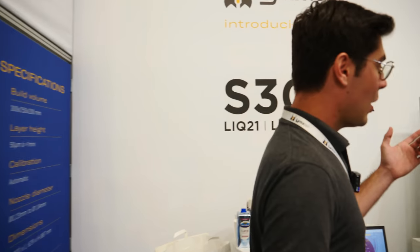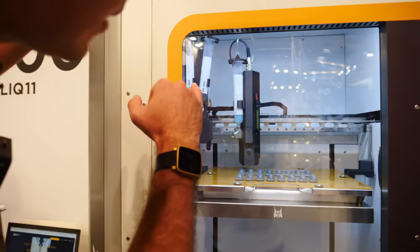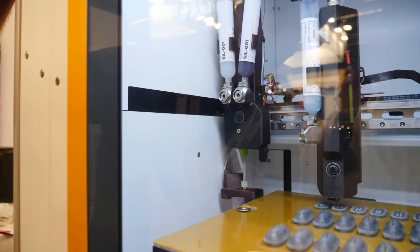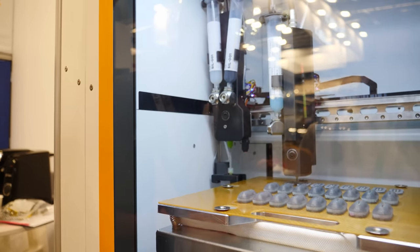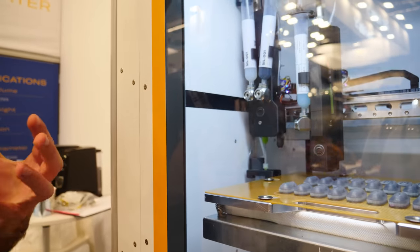Printing silicone is basically an art that we've developed over the course of the last six years. We start from a liquid formulation with a two-component silicone — it's in liquid state in a syringe or cartridge or a big bucket. It's micro-dispensed thanks to industrial pumps into a static mixer. The static mixer mixes part A and part B, starts the curing and cross-linking process, and extrudes a very thin line of silicone that stands so we can build up the layers. Everything cures together without photo activation — it's purely chemical, industrial and medical grade silicone — meaning the layer bonds extremely well together.